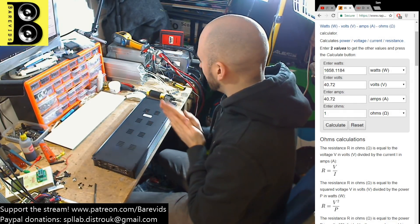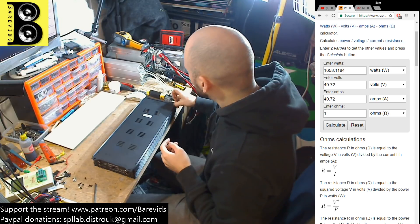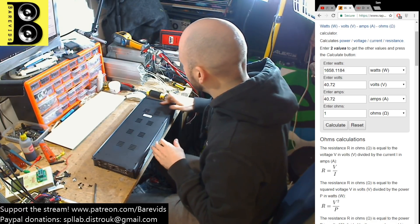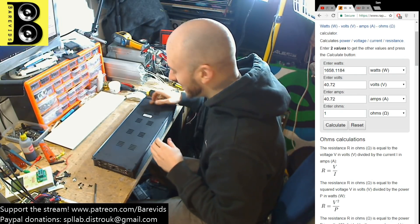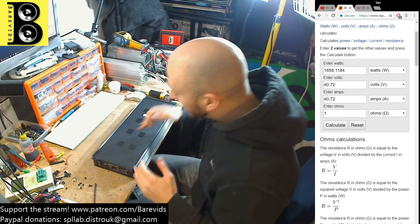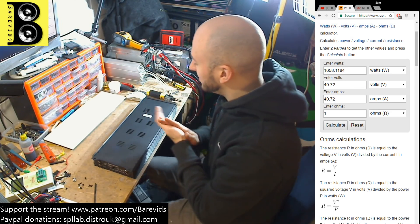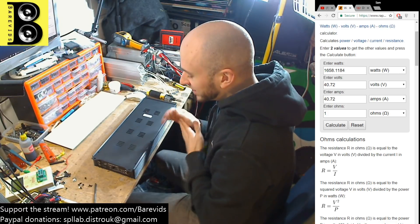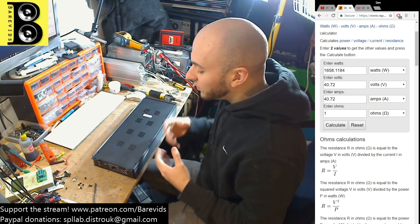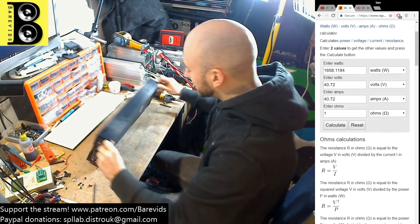Pretty decent internals for the price that DD are offering this amplifier at. It's a modern circuit design built upon an existing circuit — I think this might actually be a Chinese amplifier. But it is a Chinese circuit that has been put together very well. The inductors and transformers are seated well and won't suffer from vibration damage. The power supply is driven very strongly, we have good FETs in the power supply section, and the output section is also driven quite strongly. Everything is built to handle the current required for this amplifier to do its power over long periods of time.